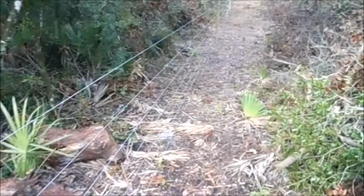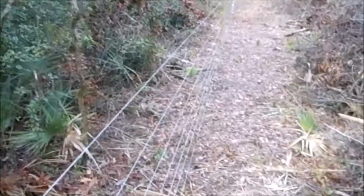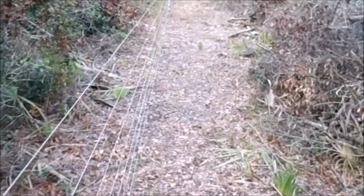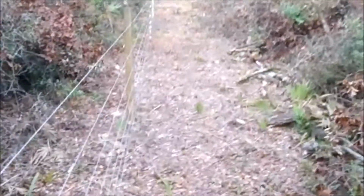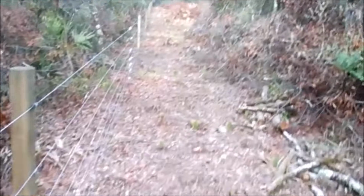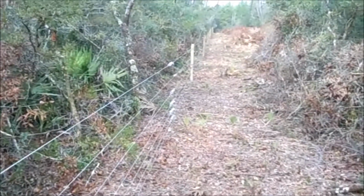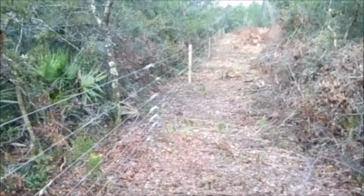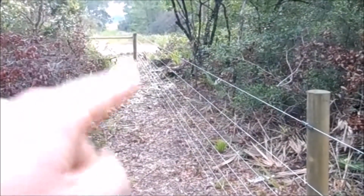And I will tell you what, tensioning 7 strands of high tensile to right around 200 to 250 pounds moved 8-inch posts that were hand set with sackcrete. So that's a lot of pressure on those posts. So the main takeaway from that was, if you do high tensile fencing, you're going to save a lot of your costs with the lack of posts in between your corners, but you definitely cannot skimp on your corner braces. You want to sink your money into your corners.